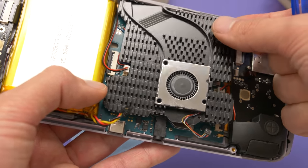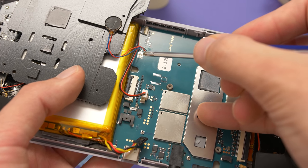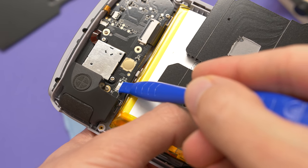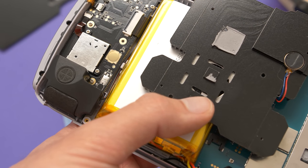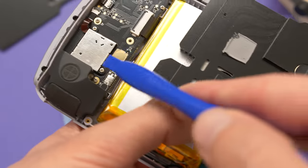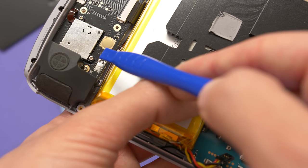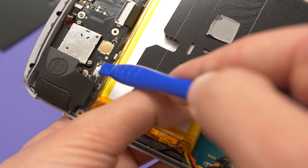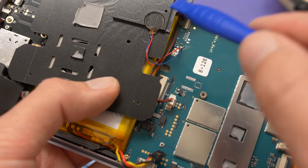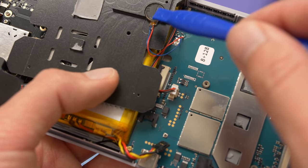We can now free the entire PCB from the assembly. If we flip this over, we can see that the rumble motor is attached in the corner. As a brief history lesson — if we look at the controller board on the side, there is an unused rumble motor spot. The original idea was to have dual rectangular rumble motors like you would find on the Win 3, but they said this device could not support a branched rumble schematic, so they kept one and had the idea it would spread from the side PCB all the way to the other end evenly. That obviously didn't work. The next best method was to put one in the center, but the rectangle rumble motor was pretty trash, so it was swapped for this circle one that works very well in its final home on the heatsink.